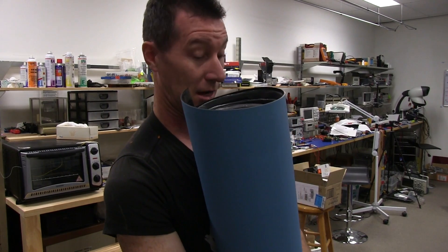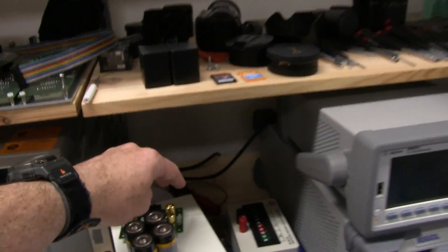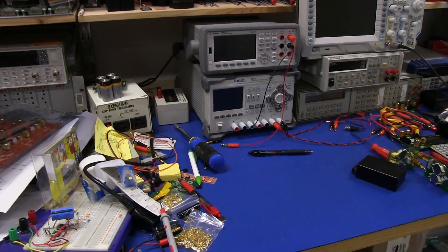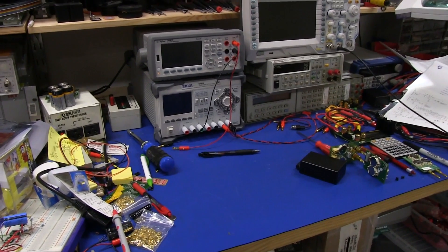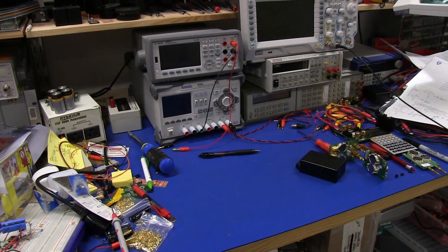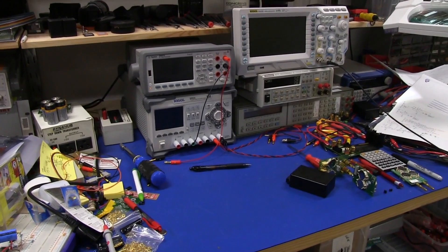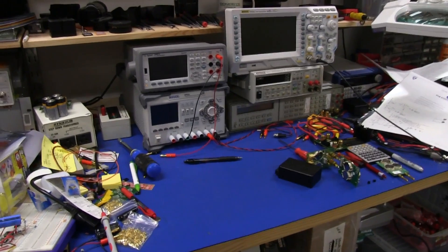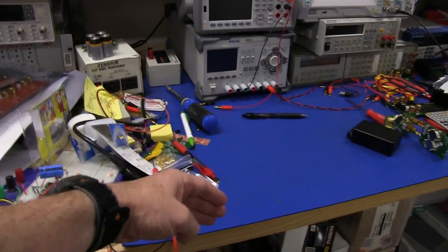As you can see at the moment I've only got sort of fixed pieces of ESD matting — two major pieces along here, which isn't too bad. But one of the issues is: A, my bench is messy, and the other thing is they don't go all the way to the back. So the plan is: these benches are 900mm deep, and my ESD mat roll just so happens to come in a 900mm wide roll. You can get them in 600mm, 900mm, and 1.2 meters.